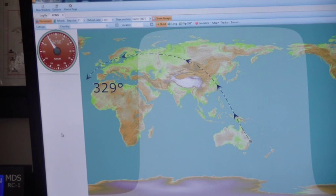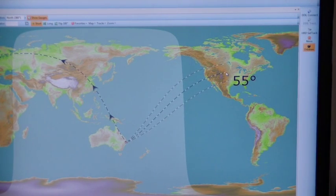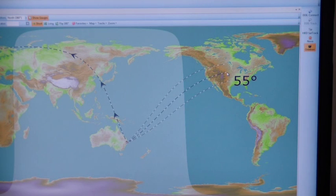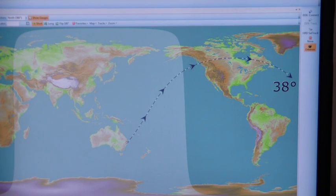We might just go over to, say, 60 degrees or something like that - it's over there to the States. We'll double click on there - 55 degrees. And there you can see the bearing, and you can see the log periodic Yagi is rotating. You can see the path as it changes. In a few seconds - there we are, simple as that. We've now got the Yagi heading at around about 55 degrees. You can also tie this up with Ham Radio Deluxe in a cluster so that you can actually click on a call sign in the cluster and it will turn your antenna, and at the same time adjust the frequency on your radio as well. That takes a lot of fun out of it though, but that's the way things are going these days.